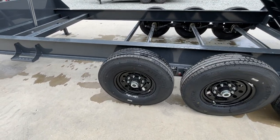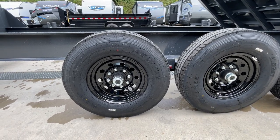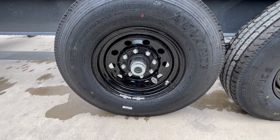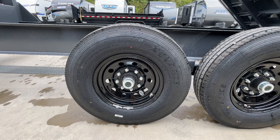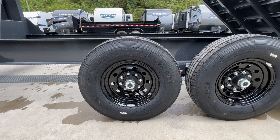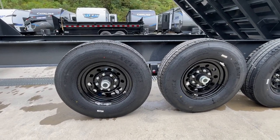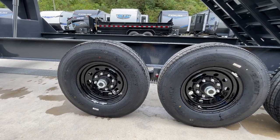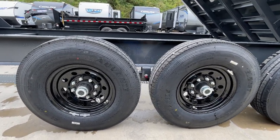10-ply rubber is standard; this one has 14-ply — a little heavier sidewall and more tread. Same black mod wheel is standard on all of them. This is an easy-lube hub with a self-adjusting, or forward-adjusting, brake assembly. Forward-adjusting brakes, similar to your vehicles, self-tension throughout the life of the pad. That's good for safety — you've always got brakes — and good for the axle supplier, since historically brakes had to be manually adjusted; if they weren't adjusted, pads weren't being used.